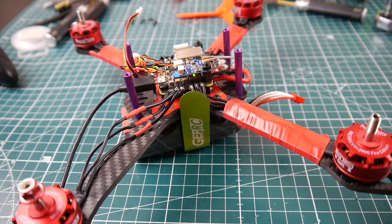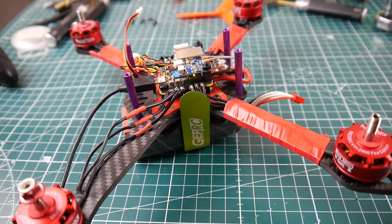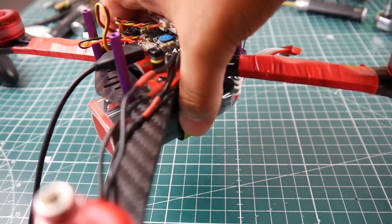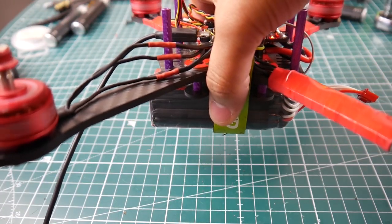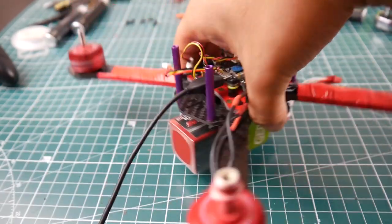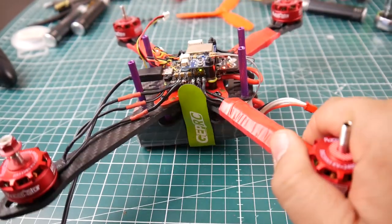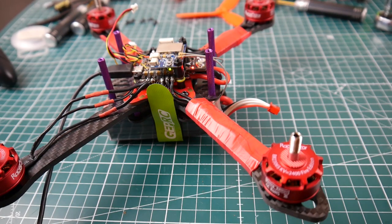It's still on 100, my D term's on 100. Let's see what happens now. This is how a motor's supposed to sound. You see that? Now look at this. That's how it's supposed to sound. It's not twitching anymore when I do anything. It's on 100, and you can feel the motors, they're going to be pretty fine. But it's still not recommended to leave it on 100, obviously.